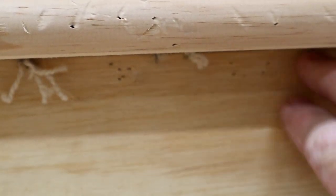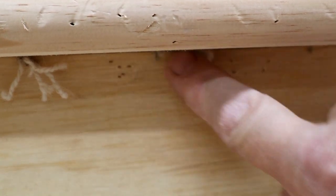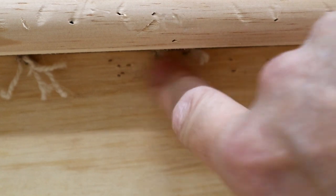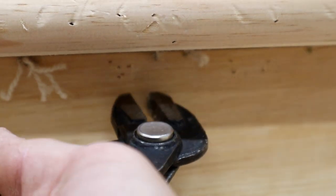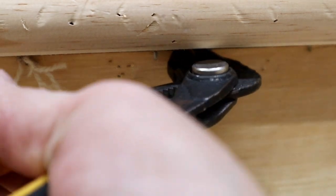Again, if there's one or two left, so be it, but I want to do my best to get them all out. If you can see that little bit right there, see that? It is stuck out just a little bit. So anywhere it's stuck out, I want to go ahead and take my channel locks, which is going to be the best thing to use in this case right here. Grab them and just roll it, okay? If you can get a hold of a staple and just roll it like so, that's going to be the best way to get it out.